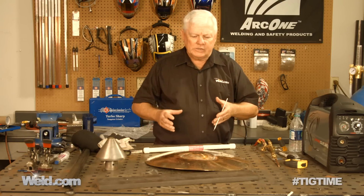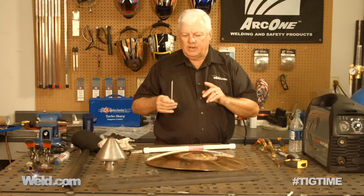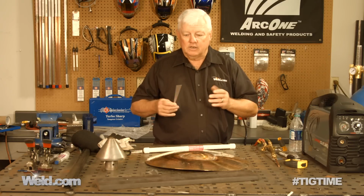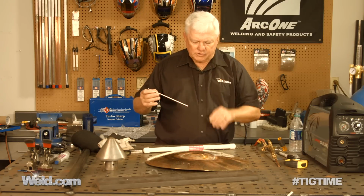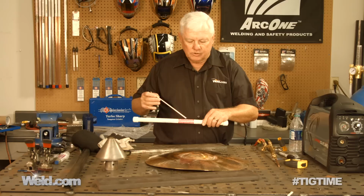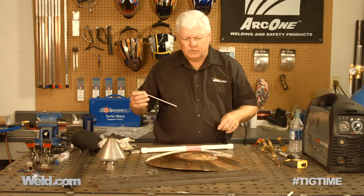So when I look at this, there are two things that I look at. One is, did this material wet out nicely? And I've got to say, yes, it did. Pretty impressed with it, actually. I'd never used it before. Again, it's called Muggy Weld, and it's SSF-6 silver solder. And you can get it in the description of the notes in this show.